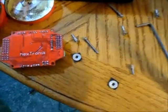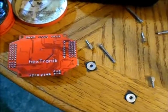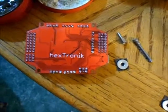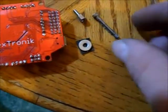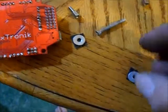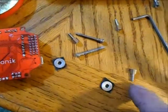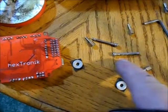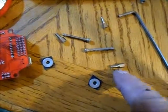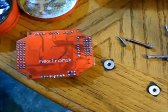Now that one of my motors burnt out, I'm not going to even bother putting this thing back together right away because I can't do anything with it. I might hook everything up and radio three of the ESCs in, but as far as the fourth one goes I can't do a thing because that motor burnt out and I'm waiting to replace it. I got one more order coming from Hobby King and in that order there's going to be some nylon stuff - nylon hardware to hold this in place: 20mm spacers, M3 x 8 bolts, and some nuts.